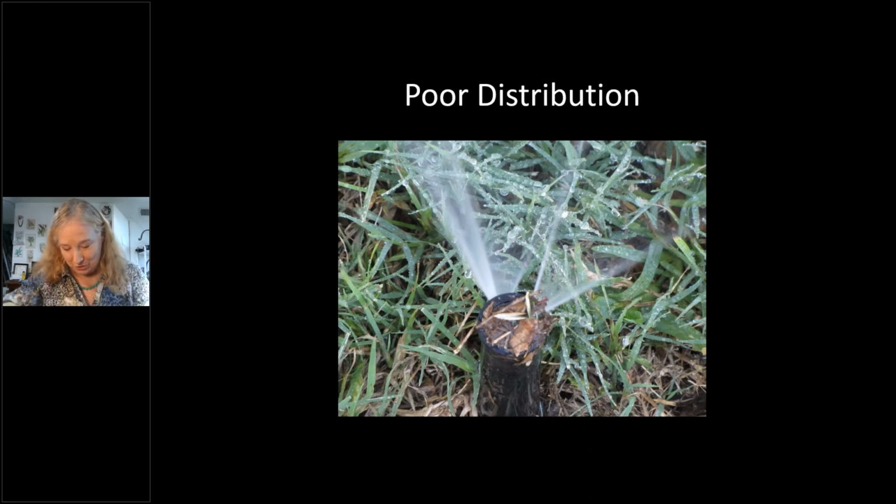The springs are really strong. And so I can pull this up. I'm going to get it up in just a minute. Okay, I don't know why my fingers aren't cooperating today. Okay, so I can pull this up and I can unscrew this nozzle. Everything's done by hand. You don't need tools. And I look at the filter. You know, there are clear filters on these also. Look at the filter and maybe swish it around in some water.